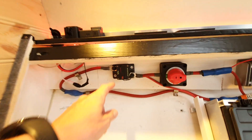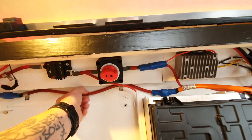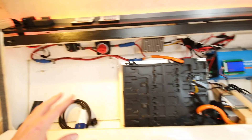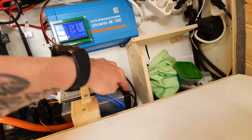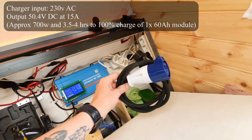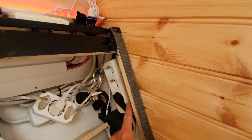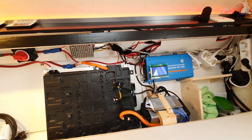It's connected through the fuse, and this is a resettable fuse. Here you can see how I wired my positive all the way up to here. Ideally you would make this wire a little bit shorter, but I had a second battery here that was connected up here. I removed that one because of the weight it was putting on the tow hitch, so right now it's only one module in here. The charger is charging with AC power, which means it needs shore power from the outside — just a cable. It has a regular RV-style power inlet, which is giving these three outlets. So the charger connects here, gets power from the outside, and when that's connected, the BMS and charger are charging the battery. Really easy.